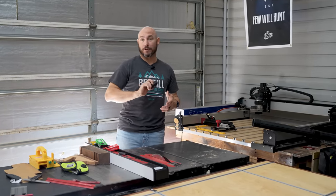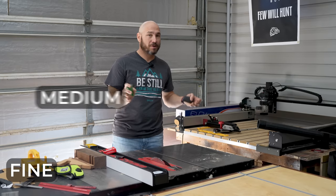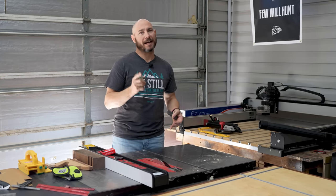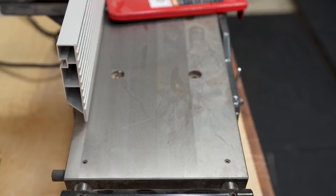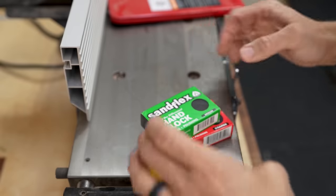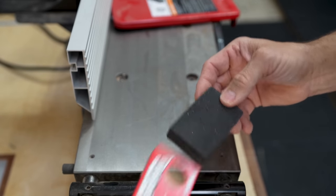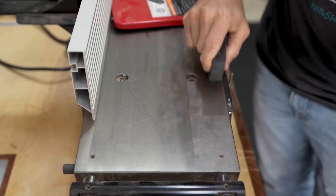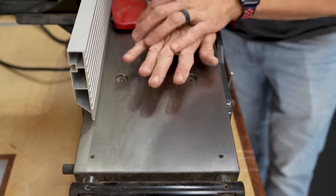It takes that rust right off — you just have to use a little elbow grease. Start with the coarse, then go to the medium, then go to the fine. Make sure that before you operate on anything like this, it's unplugged. I like that they come in these boxes — just hang on to the little cardboard sleeves so you don't get them mixed up. When you have buildup like that on your tools, when you're trying to slide the stock across it, it starts catching on it and sticking. That's going to cause snipe and all kinds of other issues, and it can be a safety issue.